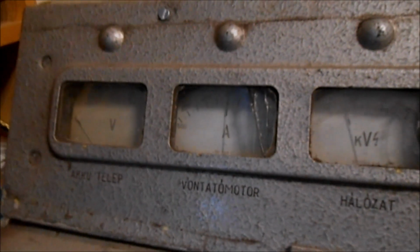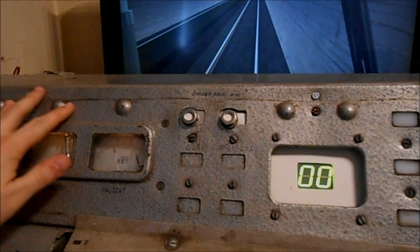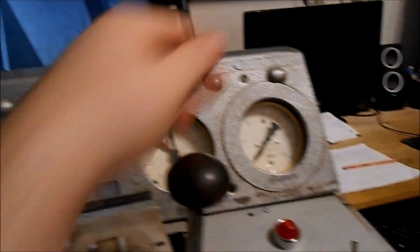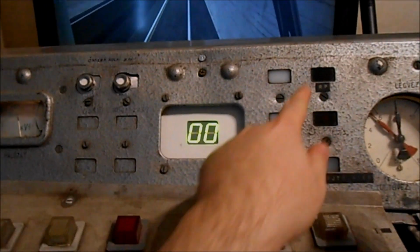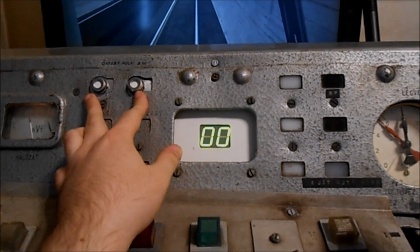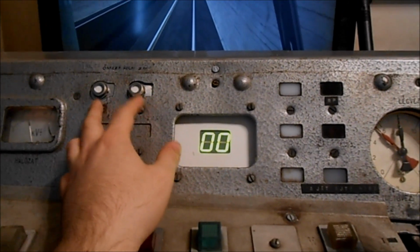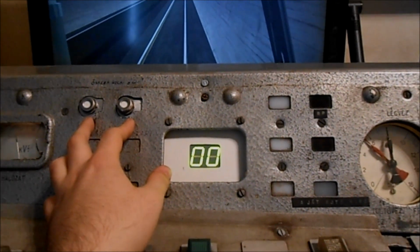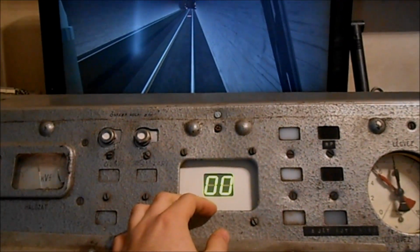And as expected, the gauge lights work too. In the end, I used 24 volt 2 watt light bulbs connected in parallel. Among the warning lights, we have an RP red, an RP green, a door fault signal and the 2 door open signals. All of them work, but in Lotus only the RP red and the door lights are used.